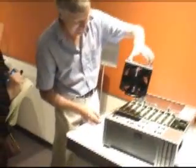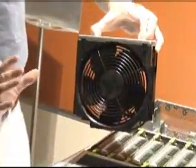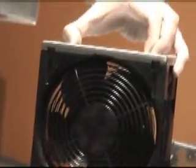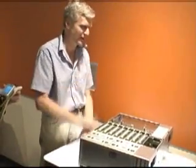Can you show us the fans again? Okay, yeah, I love these fans. Yeah, the bigger fans, I should also mention, are much more reliable because they run at a lower RPM. So what wears out the fan is the bearing ultimately, and the higher the RPM, the less long they run. We know for sure we can go to the quad-core full performance next year, no problem, because we basically have margin of error on the encoding here.